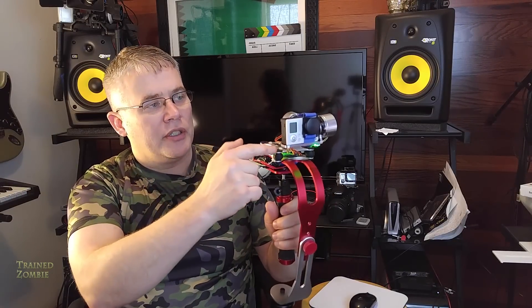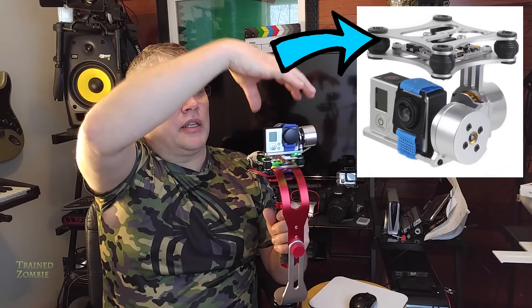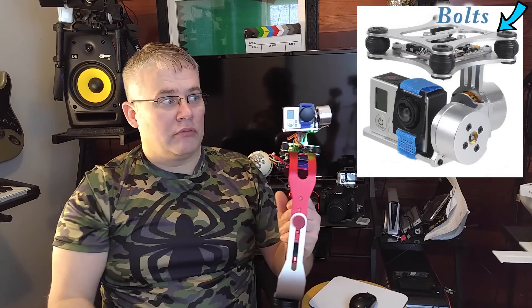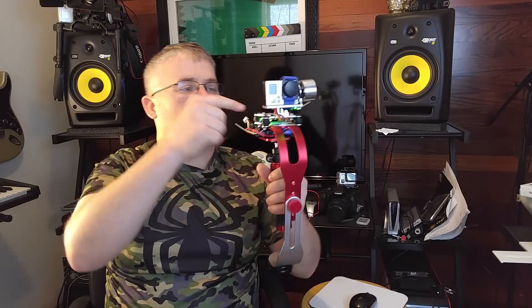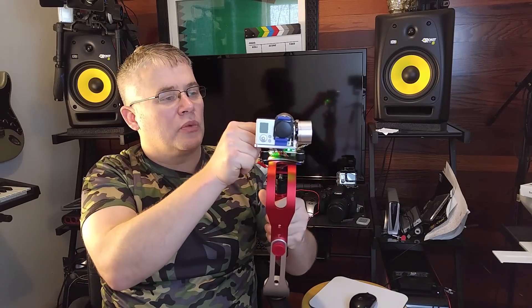Now this part is usually above the camera and it hangs this way. All I did is I took these bolts loose, mounted it the other way — I flipped this thing around and it worked just fine. It was just a matter of changing some screws. You have to take the little zip ties off the wires that come installed on it. Once you take the zip ties off, you should have enough slack to pull it around so the wires won't get pinched — because if the wires get pinched it pulls on the gimbal and you have problems.